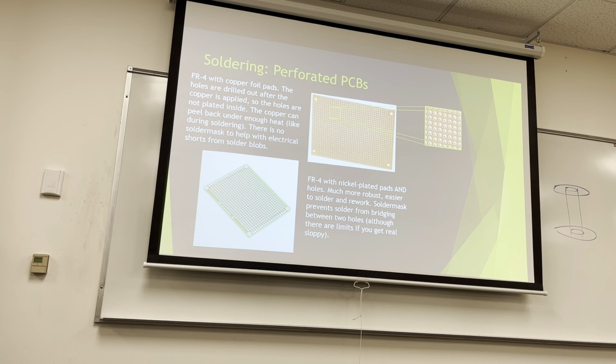When you're saying dig down, do you mean like you drill? You drill. I've had to do that with boards. Or an X-Acto knife, depending on what. You can dig with it. You can just kind of keep scraping with an X-Acto knife, and you'll eventually make it through, and you can get down to the layer. It's tedious. It's not fun. You don't want to do it, but it's possible.